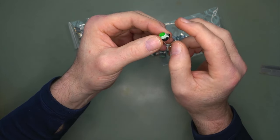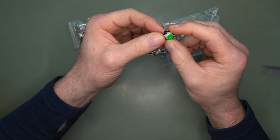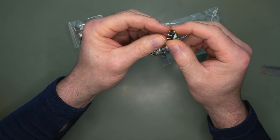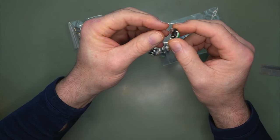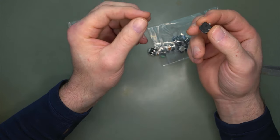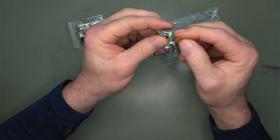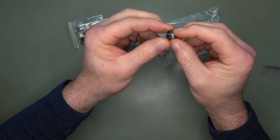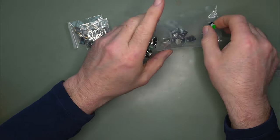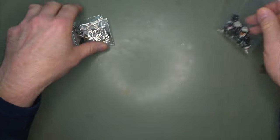When I did my board for the backplane, I unfortunately miscalculated the distance of these little pins. They're really tiny, and they can get crooked pretty fast, so you have to be careful when you do the package for this next time you do your design. Calculate your footprint twice, not just once like I did, and check again. Love those.